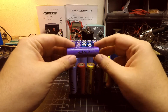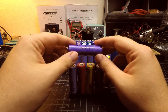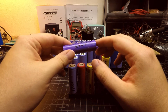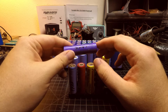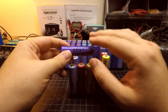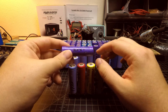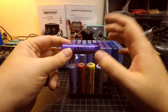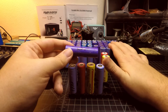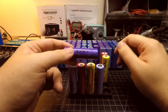These were the purple cells that came out of that Chinese-produced laptop battery pack I grabbed off of Amazon — about $1.60 each when priced new. The first battery I tested had nine cells in it, and all nine tested out between 2,300 and 2,400 mAh, which was great. They actually exceeded a little further than what I was planning on having in this battery pack. I was so encouraged by the test results of the first set that I ordered a second battery.